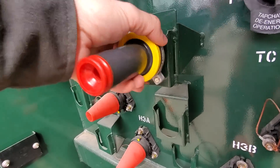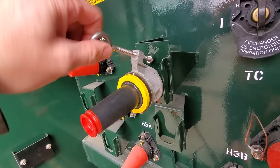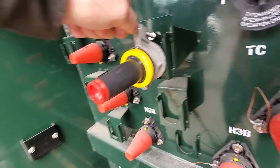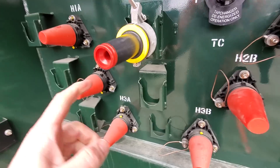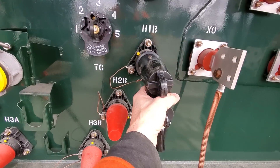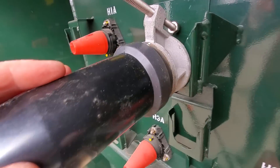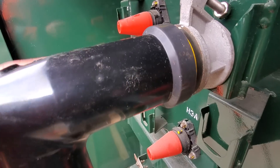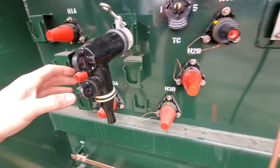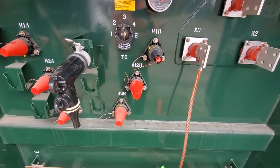Once that's dropped on with your stick using your grab all, you tighten this up and that is now secure on there. The cable is basically isolated, so we pop that off and park it on there. Make sure you can't see that yellow, red, or blue ring — whatever color it is. It takes quite a bit of force to put that on. That cable is now parked and there's no danger of it getting into something that's energized.